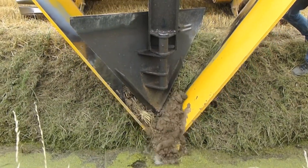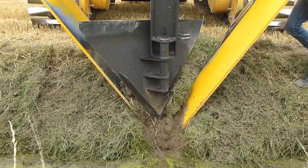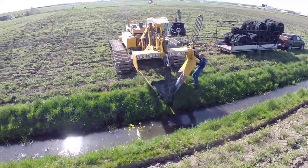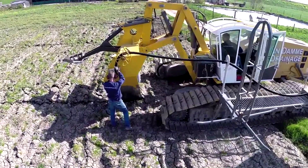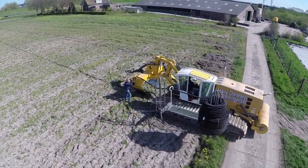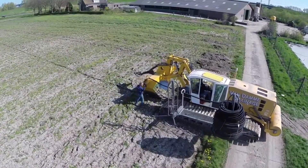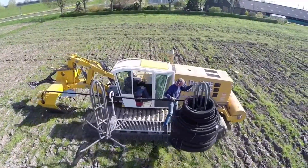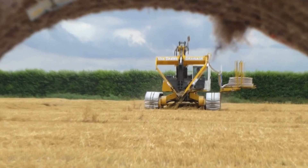Then a piping lead is threaded through. A reel with a flexible pipe wound on it immediately unwinds in accordance with the speed of cutting through the soil. The pipe is fed from the reel through the inside of the left v-shaped blade. A tractor operates at a speed of about 20 inches per second. Advantages of such laying include minimal damage to the grass cover and elimination of soil displacement.